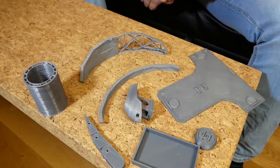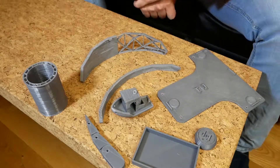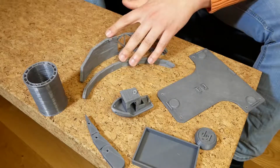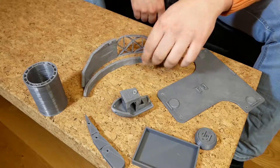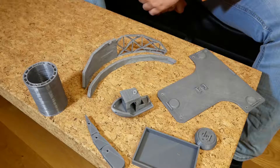So that's where I got to so far. There are definitely some problems that are problems of the printer, and other ones that are just learning curve - I've done the wrong thing, especially on these two: layer height is too high and probably too thin to hold onto the bed, I probably need a raft or something. But that's the general feedback - it's a work in progress. I'll now be able to print my own parts for projects coming up, which will be quite useful. If this is for you or not, I would expect it not to be for the majority of you, but I find it fun to figure these things out and learn something in the process.